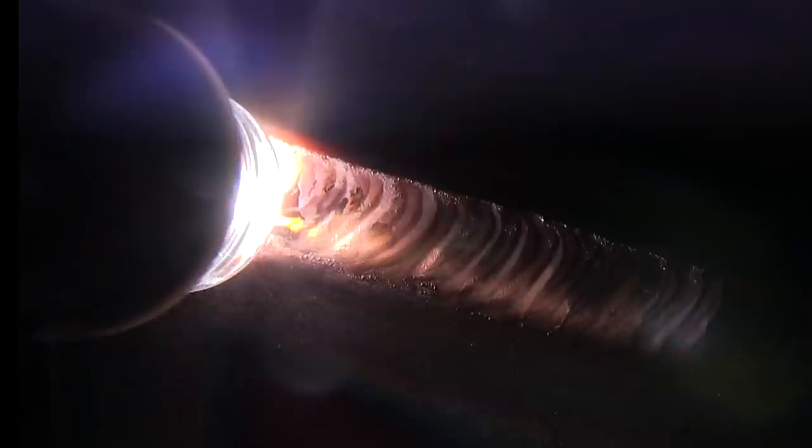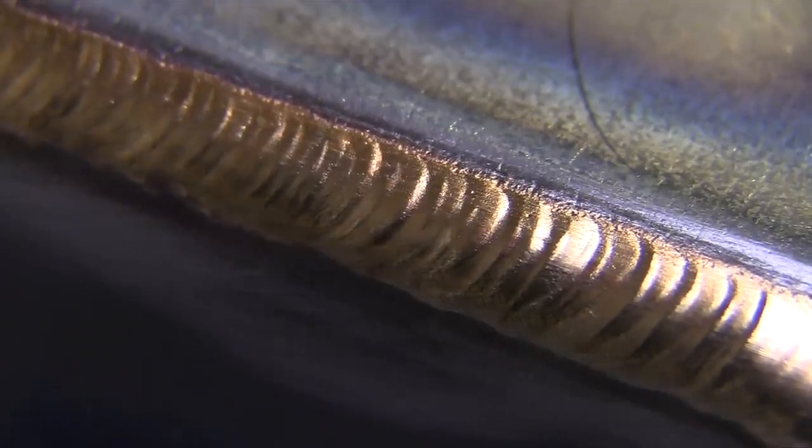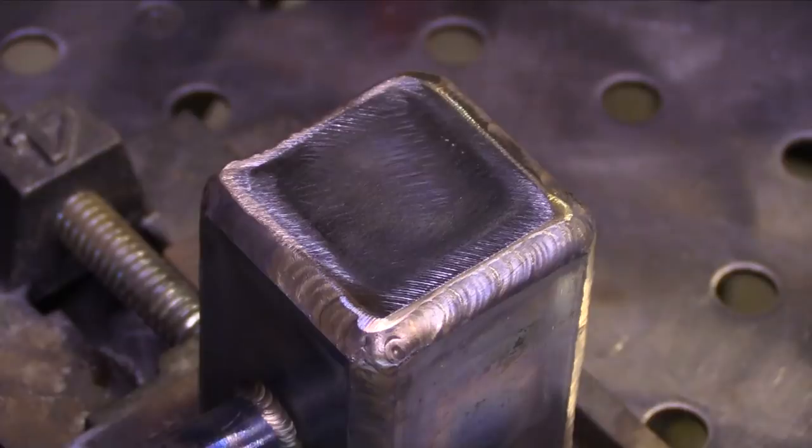The reason I'm messing around with pulse here is because I'm welding in horizontal position, so it'll want to sag on me without pulse. The bottom of that bead is sagging just a tad right now, but the pulsing lets it solidify momentarily. I'm just leaving the rod in the puddle - using a 1/8 rod - and I'm going to blend it off anyway afterwards. It's working out good.